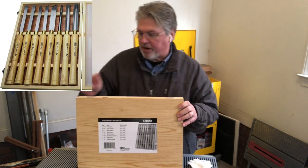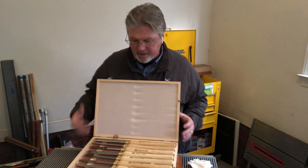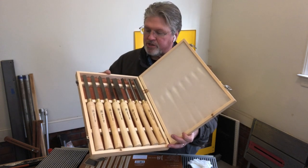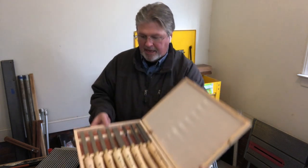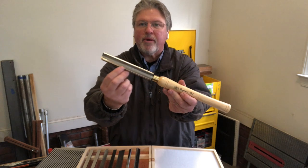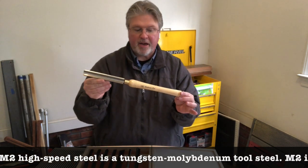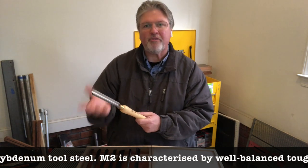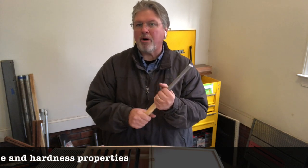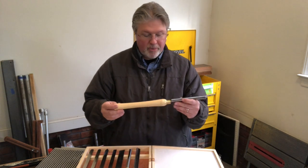So let's talk about this set. I saw this on Amazon — it was kind of a fluke that I came across it. What this is is a set manufactured in China for the company Penn State Industries. On the label it says PSI — that's Penn State Industries — and the brand name is Benjamin's Best. The tools here are high-speed steel, marked on the handle, and laser-engraved with HSS for high-speed steel. It also says the size and M2, which is the grade of the high-speed steel. The handles are some form of hardwood — not amazing, but smooth and well-finished. For my hand they're just a little bit small, but turning handles is a great first-time project and teaches you how to replicate a shape, so I wouldn't let that bother me.